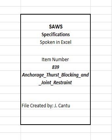12. The blocking shall be placed so that pipe and fitting joints will be accessible. 13. Pipe restraint devices shall be installed according to the lengths prescribed herein, recommended by pipe manufacturer, or as noted in the contract documents, whichever is more restrictive. 14. Pipe polywrap shall be placed between the pipe or fitting and the concrete. 15. The reaction block on the unused branch of a fitting shall be poured separately from the block across the back of the fitting. If they are poured simultaneously, a rigid partition shall be placed between the blocks.